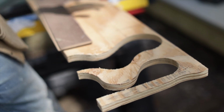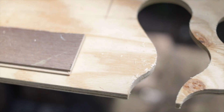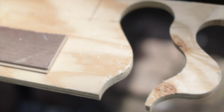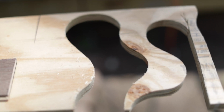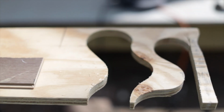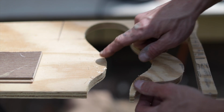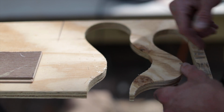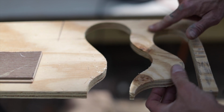All right. Now, do you see the difference in those two scroll cuts? Look at the finish of the wood, the tear through. What a big difference. And the way that these two saws go through the wood is completely different. It really is. The way that they eat through that wood was very different. Now, the Craftsman has a lot of tear through in the wood at different sections, but in some it's smooth. Now that could have been user error, but the Milwaukee has a much cleaner cut.